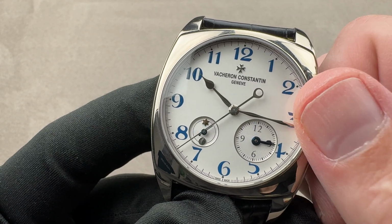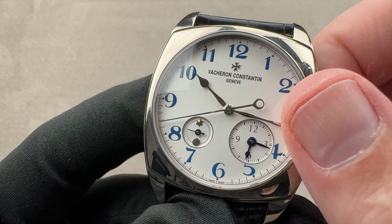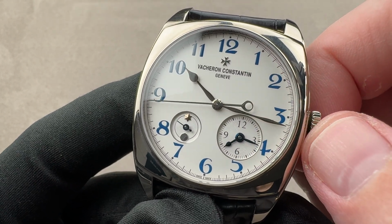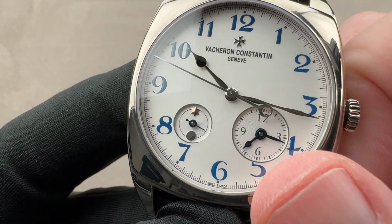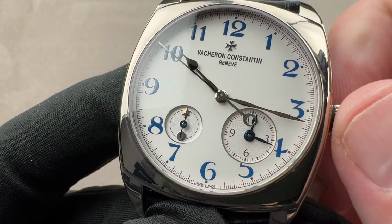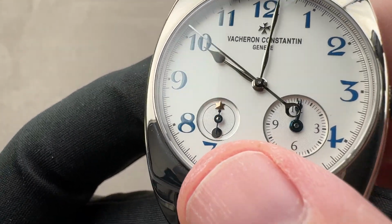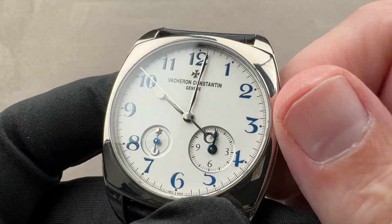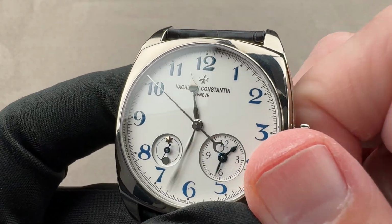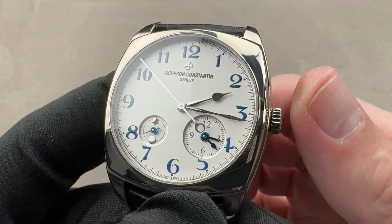So you can jump the time in hours, but you cannot set this watch, for example, 15 minutes offset between the two minute hands. But you have that day-night indicator, so even though the reference time is in a 12-hour format, you know, for example, that you are looking at right here 12 midnight, because the little index is pointing at the white gold moon. Now, when I pull the crown out all the way, everything adjusts in sync. You will note that the watch does feature hacking or stop seconds.